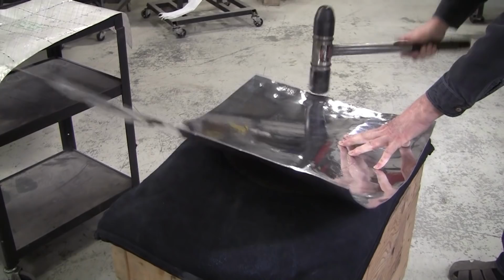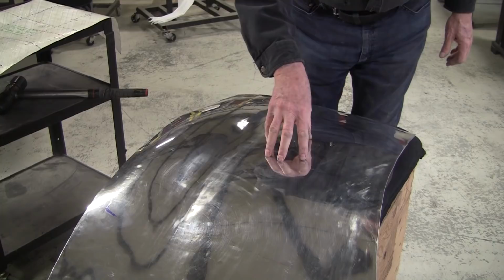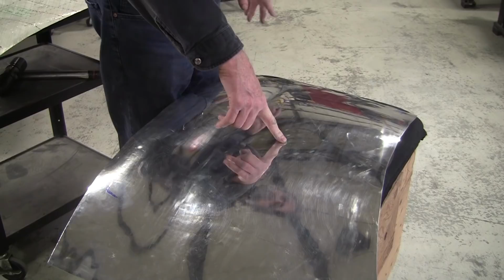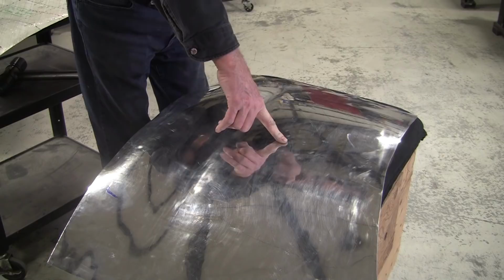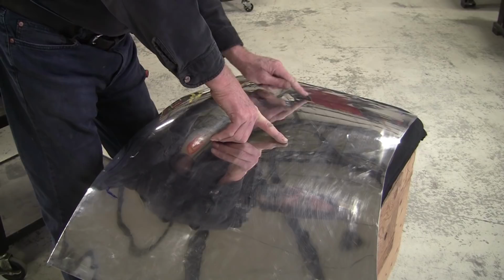So it's a tapered effect. The issue here was I probably put a little bit too much area here, and I can repair it by just bringing this edge up a little bit because the pattern was off. And I call that a tent pole when it's touching here and it's loose over here because it's been overdeveloped there. So you got to bring this up and it'll be like a ski ramp essentially, a little bit more and more and more. So there's a tapering effect. So you hit mostly on the edge and then you bring it in.